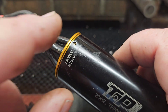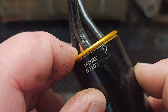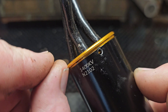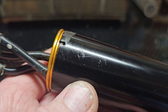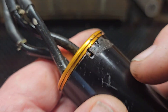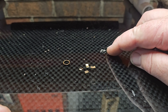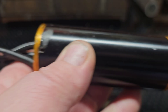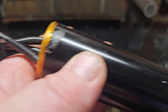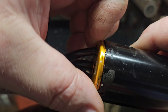That little clip was before I disassembled the motor. You can see one side is pretty much on the can, and then the other side is lifted off the can. So I decided to take it apart. I wanted to see how much these holes were wallered out, so I took the three screws out and tapped on it just enough to get the end bell off the motor can.